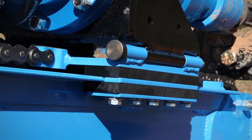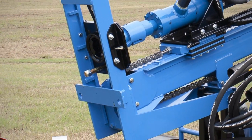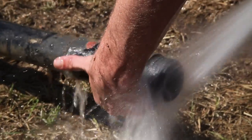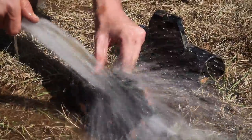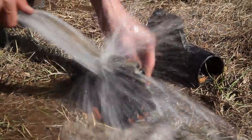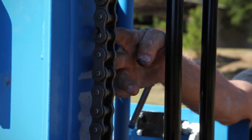Do not, however, grease the slide pad and rails. Simply keep the UHMW plastic free of dirt and do the same for the drill mast base. Before storing equipment, make sure the drill pipe threads and drill bits also are free of grease and dirt. Following every four hours of operation, check the tightness of the drive chain.